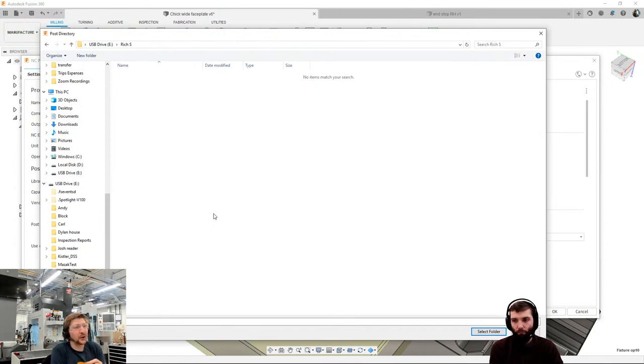And the second one that no one got is that it's for burrs and for throwing off a burr. If you tapped first and then ran the chamfer mill around it, you've got a chance of pushing a burr into the tapped edge. When you then try to screw it in, the first thing you're fighting against is a burr on that very first thread, because you're going to get some very thin points on that trapezoid shape. Rather than cutting it with a chamfer mill, there's a chance it's going to fold it rather than cut it. So if you chamfer first, then tap, you know you're going to get no burrs in that very first bit, and as soon as you tap it on the machine tool, you can screw the thread in straight away.